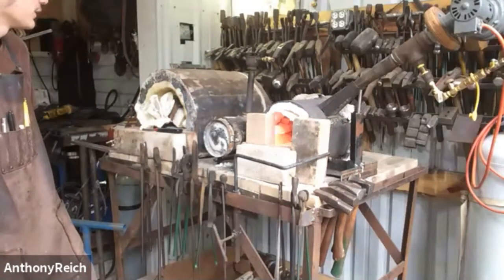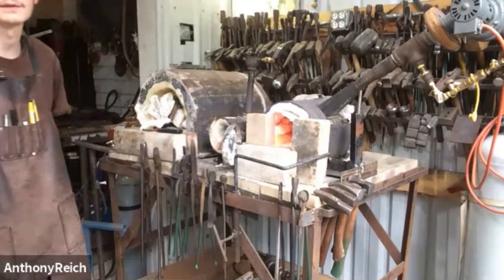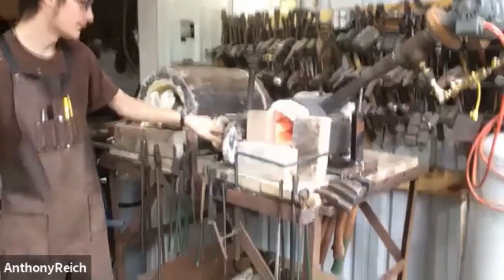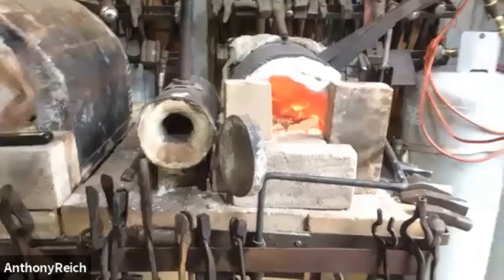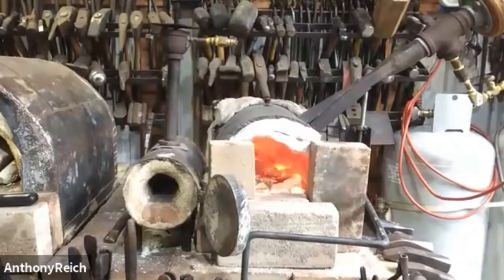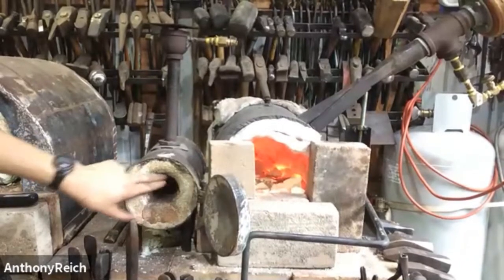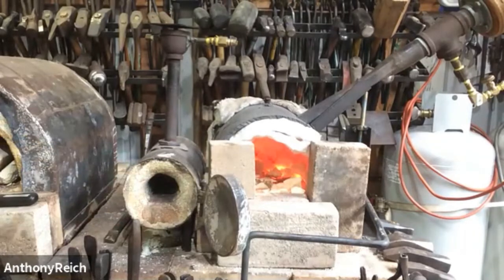But then we made this guy, we call him the pig, with a very small chamber size, maybe 2 inches in diameter. It's made out of an old fire extinguisher, and it just regulates the airflow. There are instructions online for how to make those, or you can ask somebody. We Kaowooled it, and then put Mizzou refractory or Castolite 30 around the outside. That works pretty good for leaves and small stuff, and it doesn't use a lot of propane.